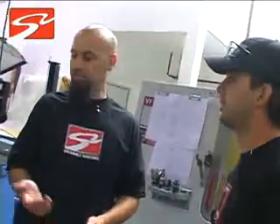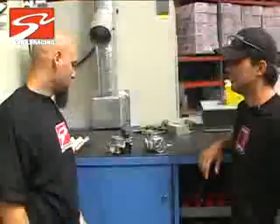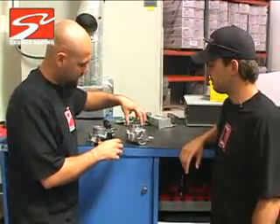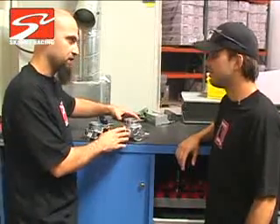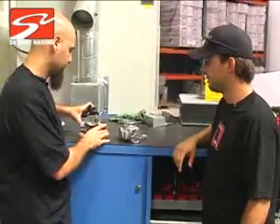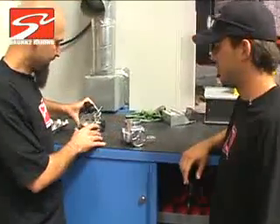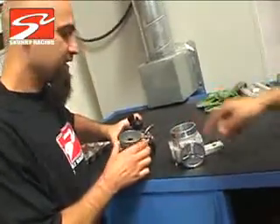So all this work that you've done — this one in particular — the throttle body is for the Evo. Yes, it's a 66 millimeter throttle body for the Evo. So after all that work, we end up with the body here, and we've actually kind of put the pulley on just to mock it up, but there's still some work left for this one. But in comparison, this is the stock unit and we're at a 60 millimeter opening here, and we've got a 66. You can see right off the bat — you can almost put that one inside of this one.